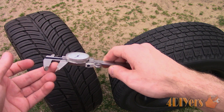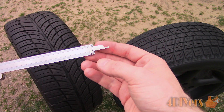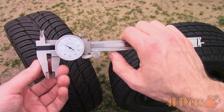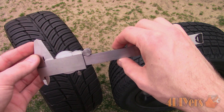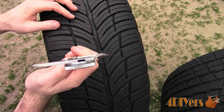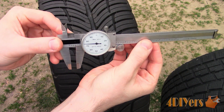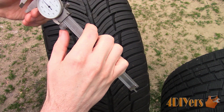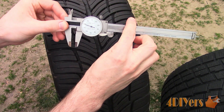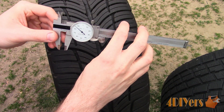As an alternative method, you can use a caliper. Calipers are available in a variety of styles, and if you are unsure how to use one, I do have a tutorial for that, which I'll include a link to in the description below. The caliper is equipped with a depth gauge — the same type of idea as a tire depth gauge — but this method is certainly much more accurate. Extend the depth gauge out to an appropriate length, then insert in the groove, remove, and record the measurement. The three measurements here are 0.275 inches, 0.279 inches, and 0.285 inches.